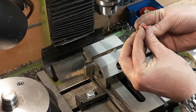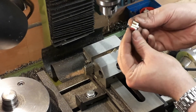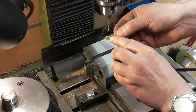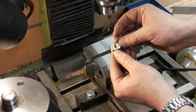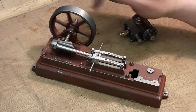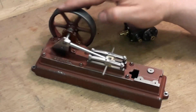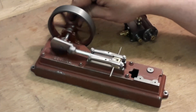There you can see it's basically finished off — cleaning up a bit, taking some sharp edges off. For the pin, to protect your vise just put a bit of brass underneath — it digs into the brass instead of your vise. There it is cleaned up, perfect, nice finish. Obviously the pin's a little bit long; we'll just put that in just to get it to show it working. It'll be even smoother with a bit of oil.